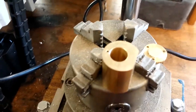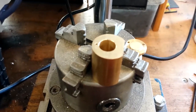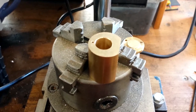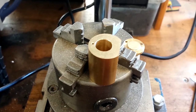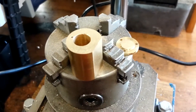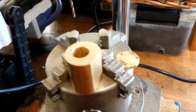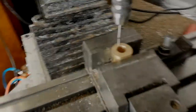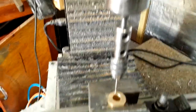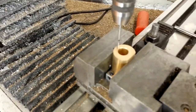Now I'm transferring the holes through from the cylinder cap to the cylinder with a 1.6mm drill, ready for tapping. I'm going to tap the first hole and then fix the cylinder so I can locate the other two holes through the cap. I ended up not using the transfer punches — just used the drill straight through the first hole in the cap. I'm tapping these holes with a piloted spindle held in the mill; I don't want to take any chances with these little delicate taps.